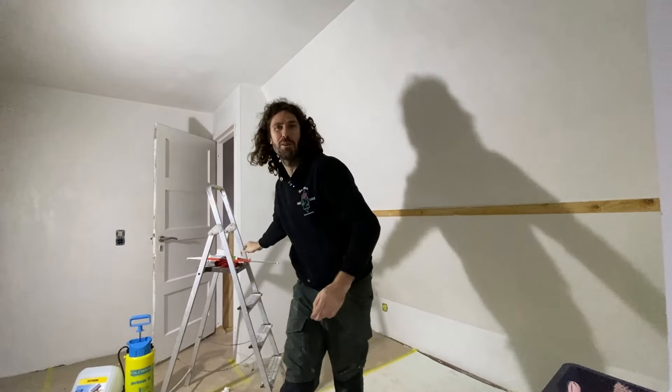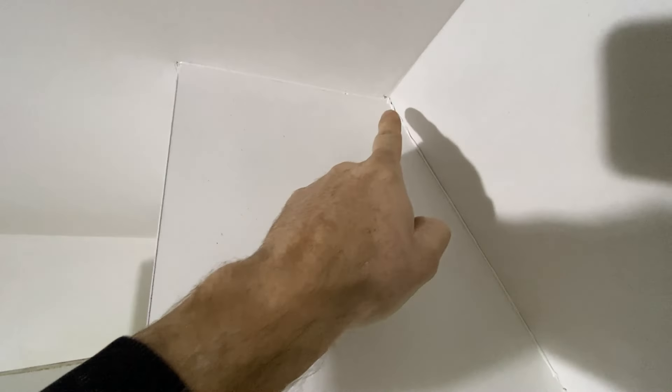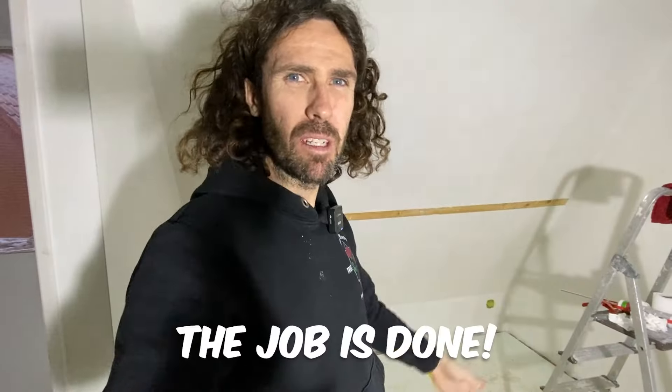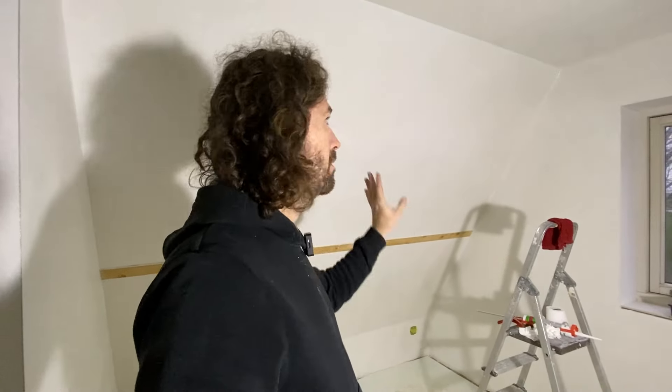Let me take the pressure off. I'll bring you over for a look at my work. Starts off at the top pretty good, and then down here it gets a little bit crusty. Down here is looking all right, that's nice and smooth. Now I've just got to dab my finger in the wet cloth and just wipe it along to get the excess bits out. I've finished sealing the gaps. Now I think I've run out of time because that has to dry before I can paint the corners. The corners are looking nice and sealed. I want to just paint some of the paint on the wall next to this one, on this spot and that spot, and then I'm going to take some home and show it to Nicky. I'll come back tomorrow and have a look in this room to see which one I like the most, because it's getting dark now. It's hard to paint when it's this dark, especially if I want to see the condition of what it looks like.